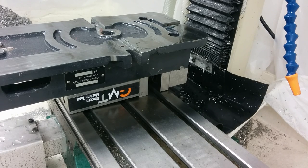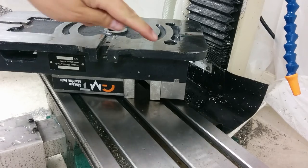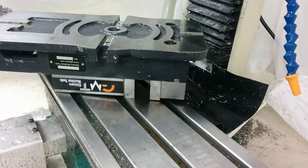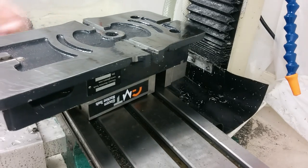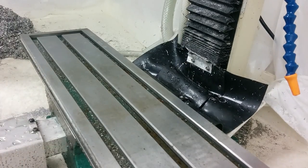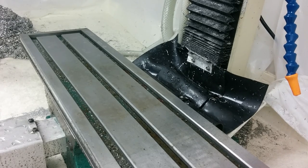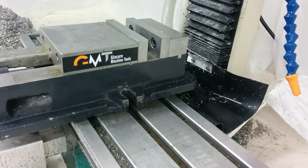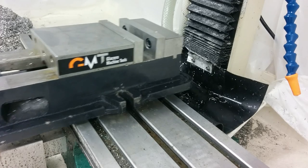Even when I take it off after a lot of machining, a film of this stuff stays on the bottom of the vice. You can see there's some discoloration on the vice — a brown stripe and another one — but that's fine. Discoloration is one thing; it's not pitting, it's not ruining the surface. The table still looks clean. That scratch you see is actually just a scratch. That's also because I clean my vice thoroughly before taking it off the table, so I can flip it around without gunk falling all over.